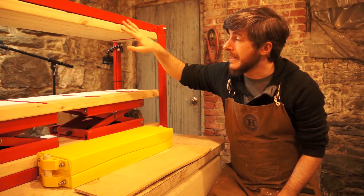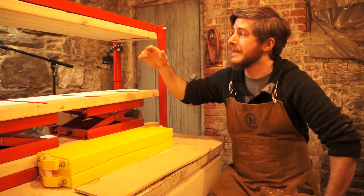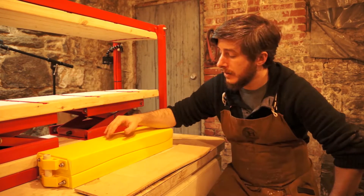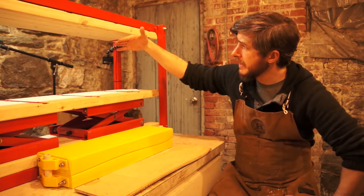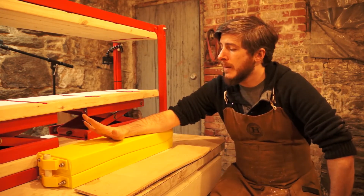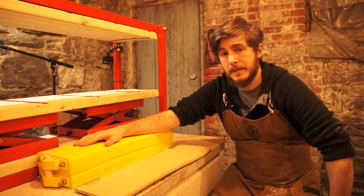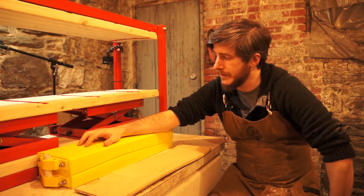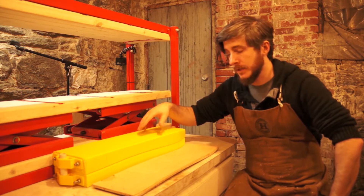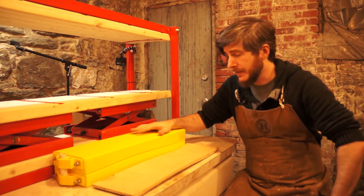That was super surprising. I think my stave and spar system was just not as rigid as I was expecting it to be. Oh my god, it's so bent. I've got some ideas on how to fix that. That said, the mold worked perfectly. The corners of the mold got crushed down a little bit because the surface it was being pushed against was effectively curved. So I may consider swapping out the fill material for concrete in the future, and I also thought about doing some chopped fiberglass mixed in with the plaster so it's got a little more internal strength. If you've got any ideas about what I could use to fill these shells — easy to pour, strong, not crushed down — I'd be happy to hear it.